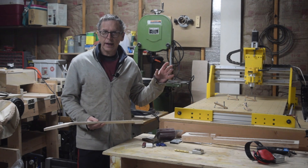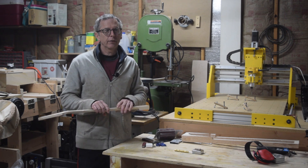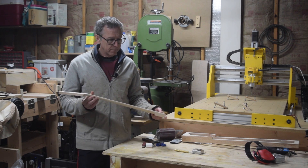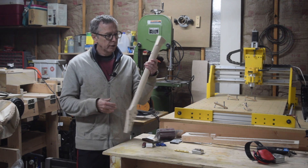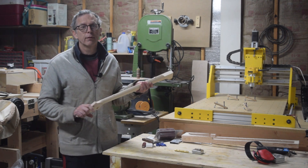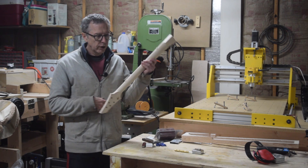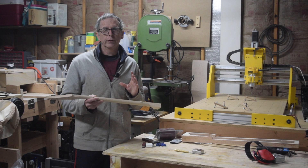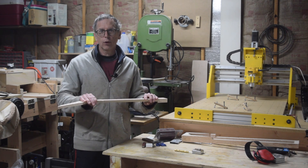That's the process I use for making a laminated blank and then carving the neck on my CNC machine. You've probably seen a lot of guys making laminated necks featuring a variety of different wood species — and while this neck is basically just maple, the process is exactly the same. The key is to make sure your grain is oriented properly: you want the grain on one side of the centerline mirroring the grain on the other side, which helps prevent the neck from bowing and twisting. What's happening on one side is cancelled out by what's happening on the other side. Also, you want the grain running vertical — straight up and down — which yields a neck that will resist the effects of string tension and be less likely to bend or warp.